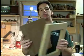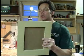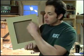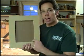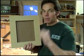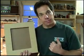a panel to the back. You're just going to merely glue and nail that panel on there. Now, I'm going to put some quarter round or shoe mold trim in this case around on the inside. We'll miter that out. I'll show you that next.